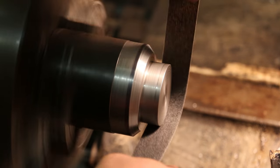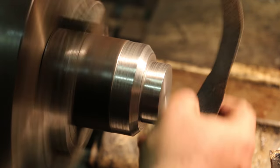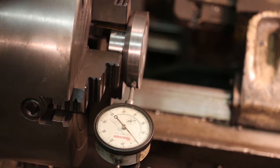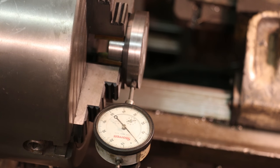Now I'm just going to come in here and take some emery and polish this up. What we did next is we parted this off. I apologize — I got through parting it and realized I had forgotten to hit the record button, so you missed out on the parting action. But if you watch my channel, you've seen that before. We parted it off and I then put in my four jaw independent chuck. I put some little brass spacers behind the jaws to protect and keep from marring up that surface, because that is the finished surface. We got this thing dialed in — there may be a couple tenths of a thousandth of an inch of runout, but plenty good for what we're doing.